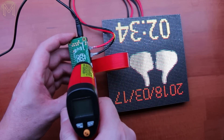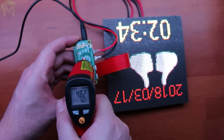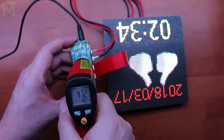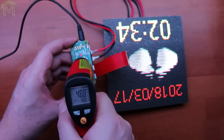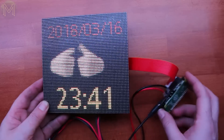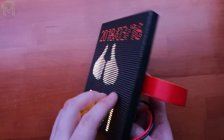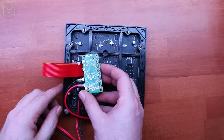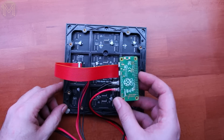The peak temperature is around 50 degrees Celsius, with an ambient room temperature of around 30 degrees Celsius. When you build an enclosure for this, make sure that there is adequate ventilation. Speaking of enclosures, you can do away with the long cable if you buy a female-to-female header and mount the Pi hat directly to the panel — this is something that I'll definitely be doing.